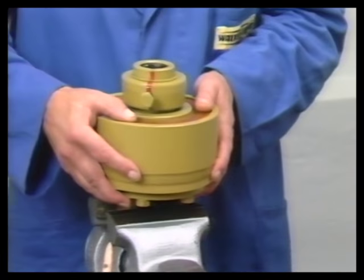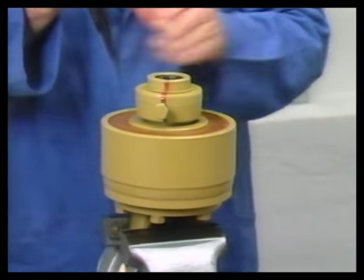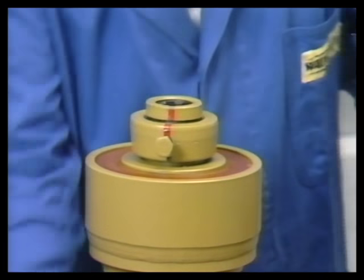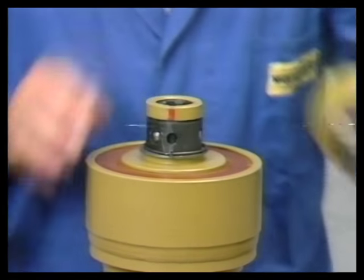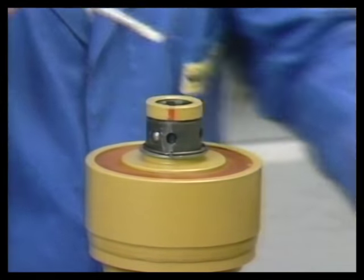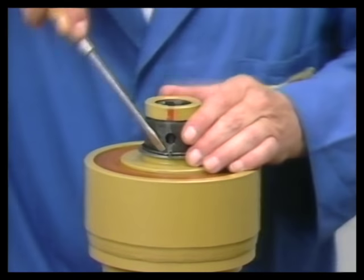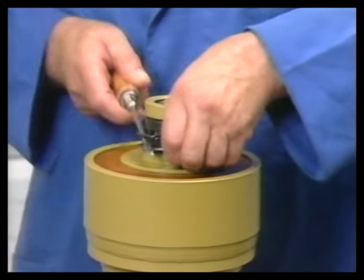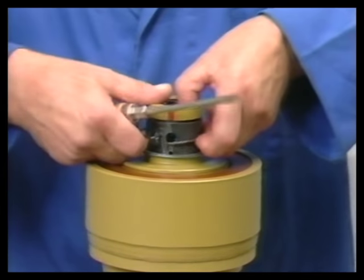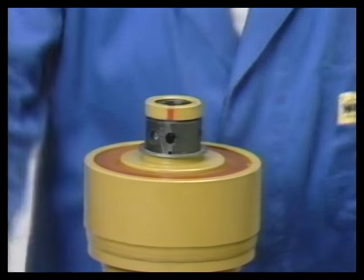To dismantle the K64, first, dismantle the QC lock. Remove circlip, retaining sleeve and locking balls, lift off torsional spring from the sleeve bore, pull out clamping key, then remove torsional spring and finally washer.